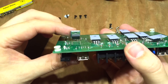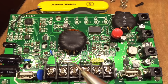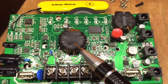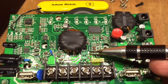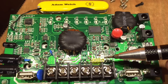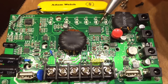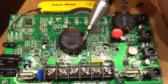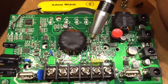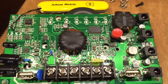That XL4016E is probably the buck regulator for the 5-volt rail. Looking at the top of the board again, we've got the large inductor, some low-value resistors that could be used for current sensing, a 20-amp fuse in this 10-amp charge controller, and another chip up here that's completely anonymous. I'm thinking there's a good chance this is going to do some MPPT, so I'm going to put it all back together and get a solar panel and a battery plugged in.